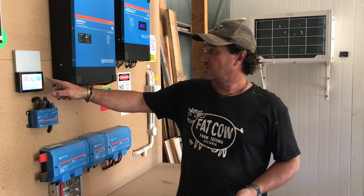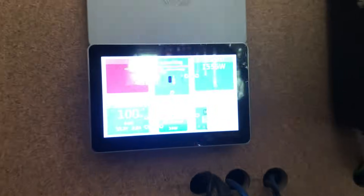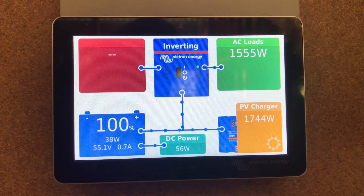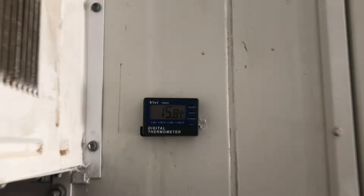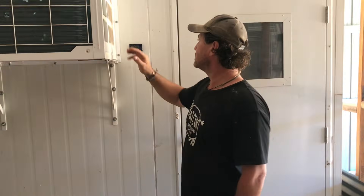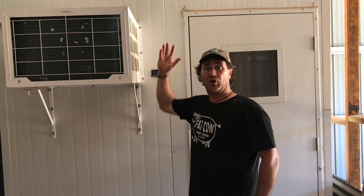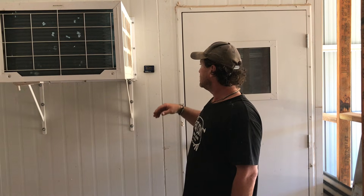What's happened is the air conditioner has kicked back in, so we're running at 1,500 watts now and the shunt has seen that and is giving us more power. Looking at the temperature display, it's now kicked in — it's set at 16 degrees and the load has increased, so it's dropping that temperature again, dropping to 15, then dropping to 14, and so on — that's how it all regulates itself.